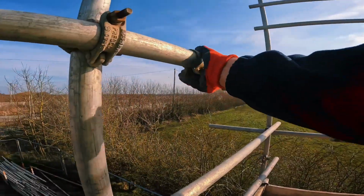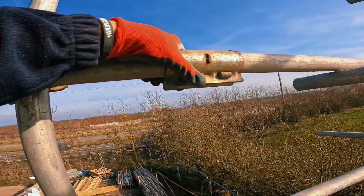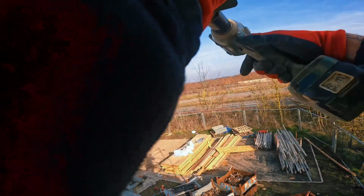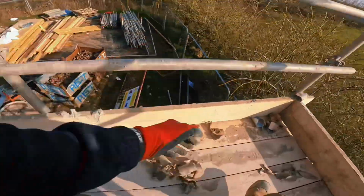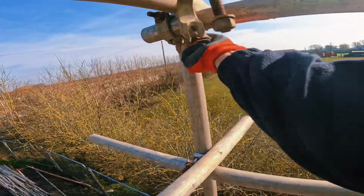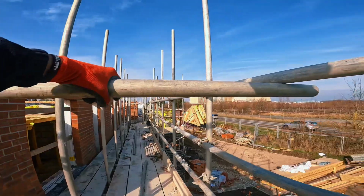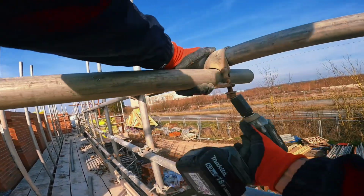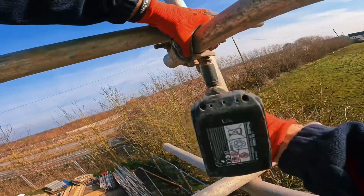Sleeve is sort of a 5 foot right now. That should meet the corner nicely. Look at that. You know it's flush when it slots straight in like that. Some sleeves are bent also. Connect that straight up with 2 singles. The inside of this gable's already braced and levelled, so this will only have a little bit of movement. Give it a little play, see where it lands. Stick it on. Tighten both of them.